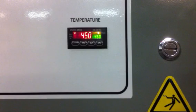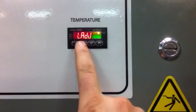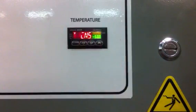We want to change the display on the temperature controller so that it matches what your heat strip or temperature probe shows. Press the gray button one time, the circle button one time, and then one more time — it shows INS, which stands for input shift. We want to drop the display 50 degrees.